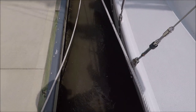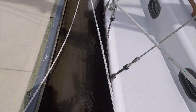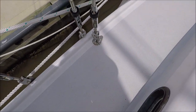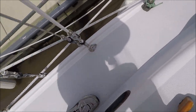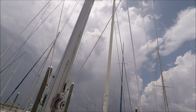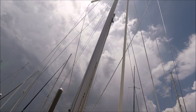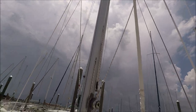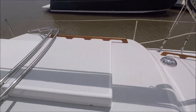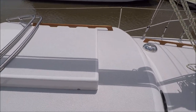These are all new external chain plates. And these pad eyes here are for the aft intermediate shrouds to support the mast against the pole of the inner stay when it's deployed, and also provides some redundancy to back up the rig.